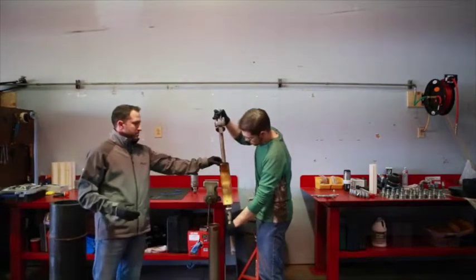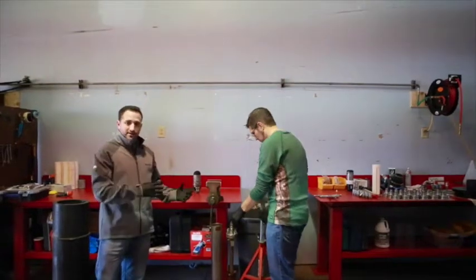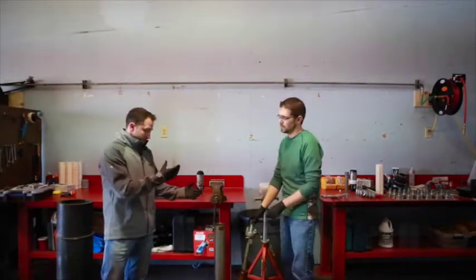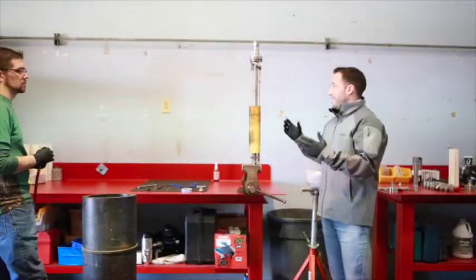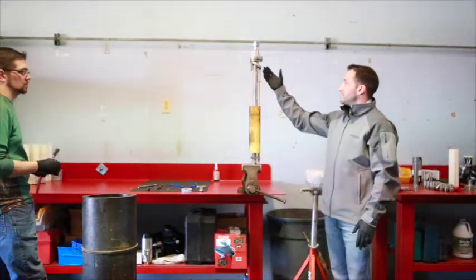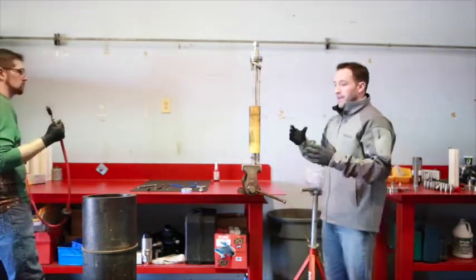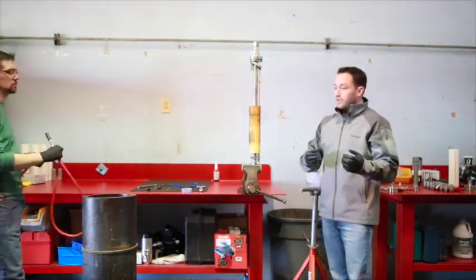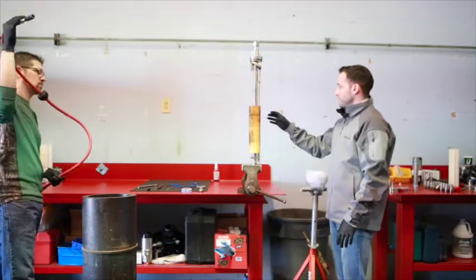As you can see, there's quite a bit of scaling on this. What we'll do is take some time and spray this pump off — nothing really to show there, just hosing it down and cleaning it up so we can actually work on it. Now we have it cleaned up, hosed off, and wiped down. You can see the excessive scaling that was on top of the rockers literally just washed right off. I cannot stress enough how important the soaking bath is — the longer the better. It just makes things so much easier when it comes time to inspecting and servicing the pump.